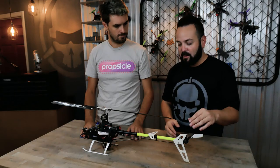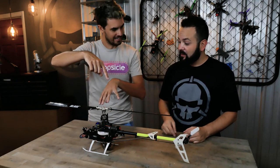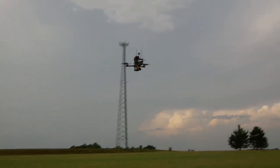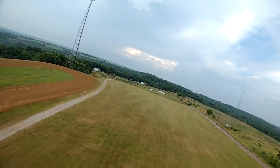Everything's run by servos. The servos are going to tilt the swashplate, and depending on the direction of the swashplate, that's the direction it's going to go. The whole job of the tail is to counteract the torque that the main rotor is making — because if the rotor is whipping around, the body would want to go the other way. This could get a little awkward flying FPV because of tail blowout: if you give it an abrupt collective pitch, a lot of times the tail will kick out on you.